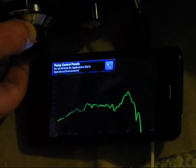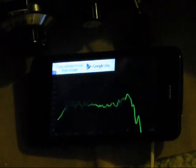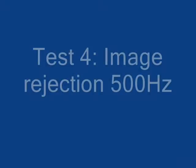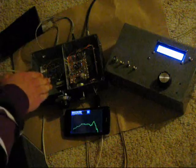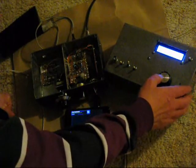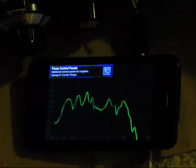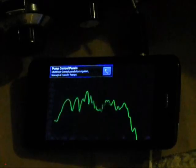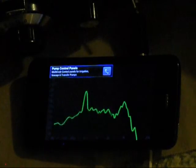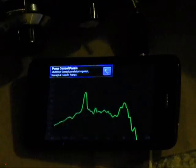Very clearly the difference in the signal. The strongest signal you heard was in the correct lower sideband, whereas this receiver was set up to reject the upper sideband, and it was significantly weaker. The receiver is set up to 3.500 MHz, as is the N3Zi DDS, hence nothing is audible as we are exactly zero beat. The signal generator is now at 3499.5 kHz, so it's a 500 Hz tone, and it's reading around minus 22 dB on the phone. That's our reference.